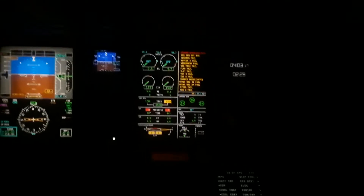Well, you can't see it, but I'm going to turn off the batteries. It's the standby bus that's powering it right now. Battery one is off, battery two is off, and battery one is off. Make sure you don't leave it like that for more than 60 seconds — otherwise you get a battery discharge warning and the battery discharges and you have a dead battery. That's not good.